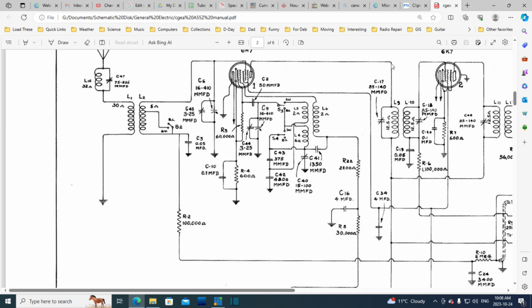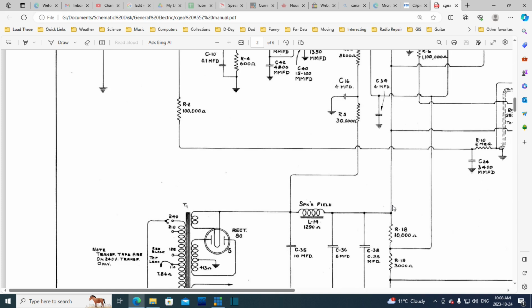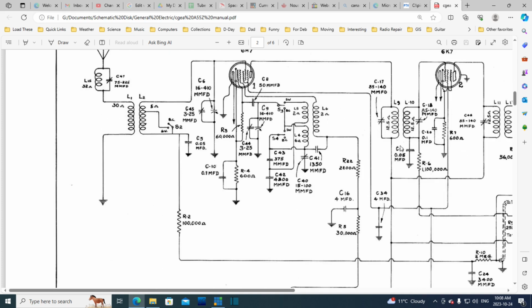The 460 is going to have a great time in this circuit here. This circuit is designed to resonate at 460 kilohertz. The other signals that I talked about, including the antenna signal, will see this kind of like a short to ground somehow. There should be a capacitor on here somewhere. Okay, well, I don't know what I'm talking about, but that's okay. I'll just keep talking anyway. So the other signals are not going to go through this transformer. Just the 460 is going to go through. This side is also tuned to 460. So by the time you get over here, the other 3 guys are gone, and you've got just the one resulting signal.